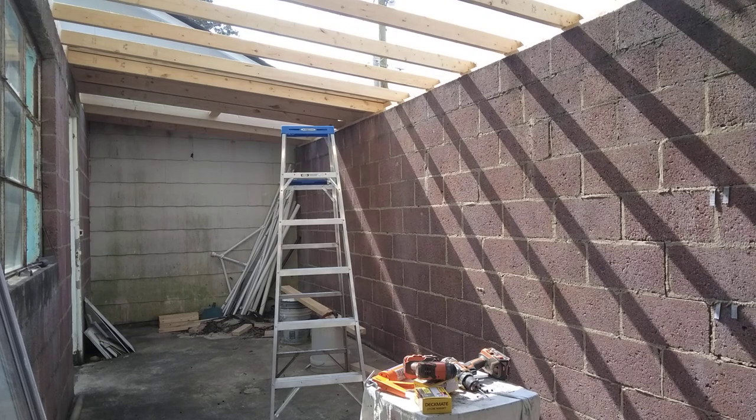We're inside and starting to get some shade with our panels — it's going to be nice and cool in here when they go up. The old roof had a nice pitch to it, so it would be good for draining. The framing overhangs the walls about 10 inches, and our tin overhangs the framing by 3 inches, so it should be pretty good as far as keeping the weather out.